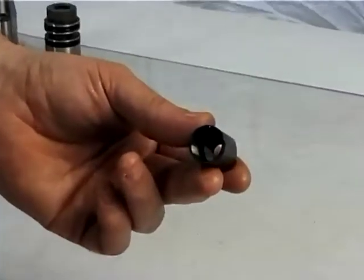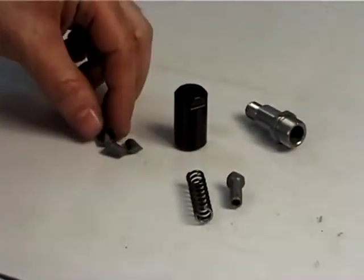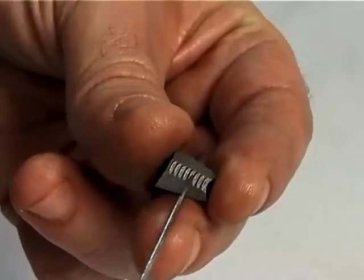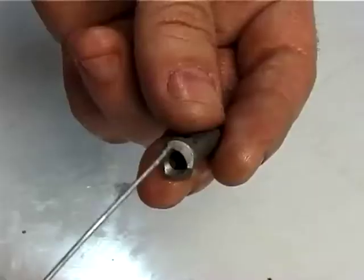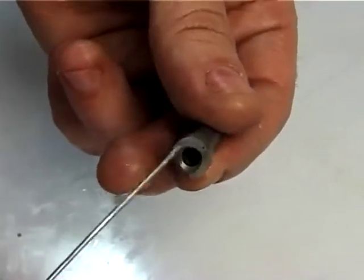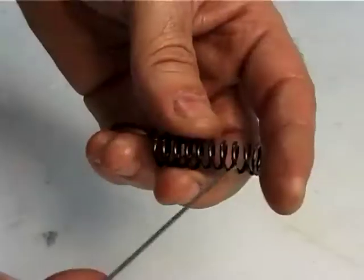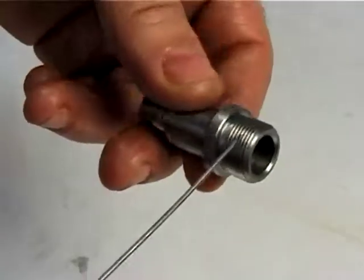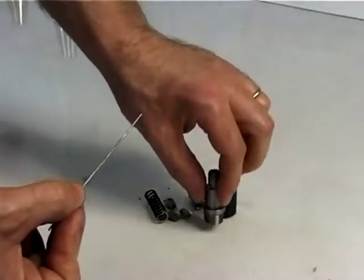Check that the clamps holding cone, figure 17, is not damaged. Check the wear of the 3 clamps, clean them or replace them as necessary. Check that the 3 surfaces of the clamp opener are not damaged, figure 19, and verify the wear of the spring, figure 18. Check that the threads of the cone holder, figure 20, are not damaged. Replace them if necessary.